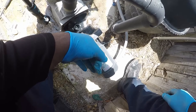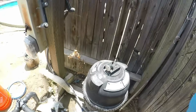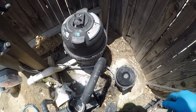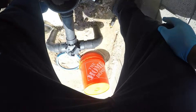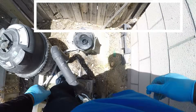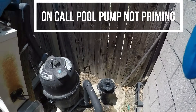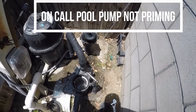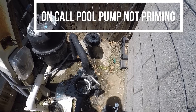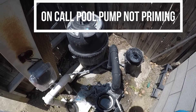Let's see what happened. We opened it up and we have a broken impeller that did not let this start up. Because the homeowner has a home warranty, I'm going to have to call the homeowner, let them know we got a broken impeller, and see if they want their home warranty to get involved. This impeller repair is going to cost a few hundred dollars, so I'm going to probably bolt everything back up so the home warranty company can come out and do their thing.